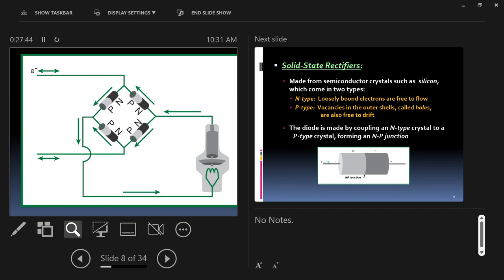All the while, notice the diodes direct electricity only in one direction — it always comes out the same end and through the x-ray tube. Electricity is never allowed to travel across the x-ray tube in the opposite direction — it can't happen, because of the way the diodes are set up in the rectifier bridge. In the next slides we'll look at what in the diodes allows them to change their function back and forth depending on the direction electricity travels.